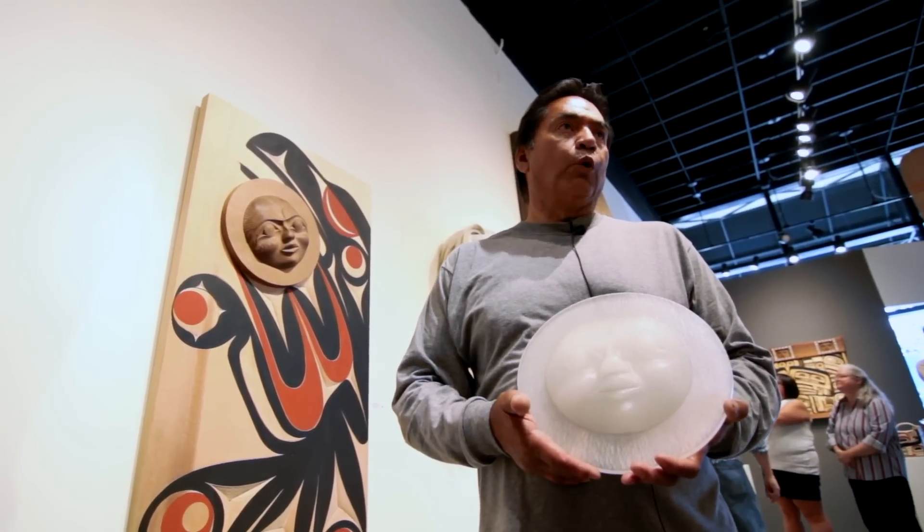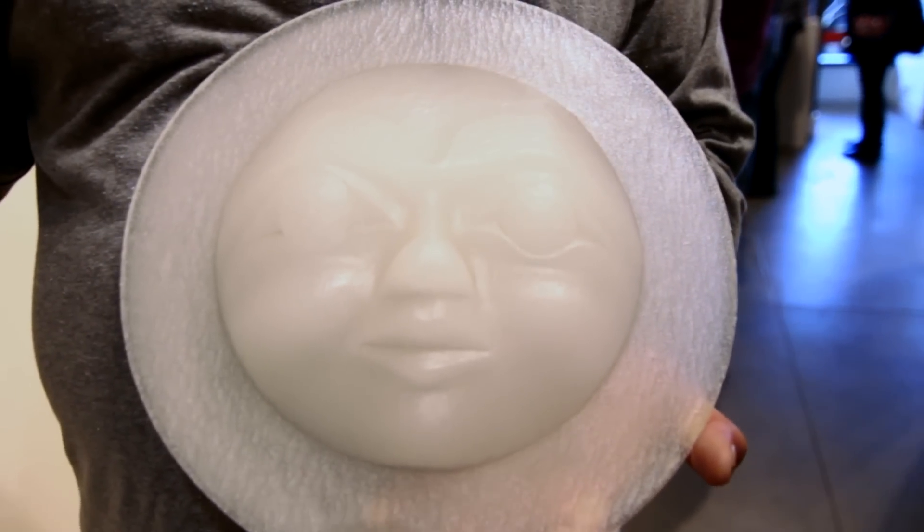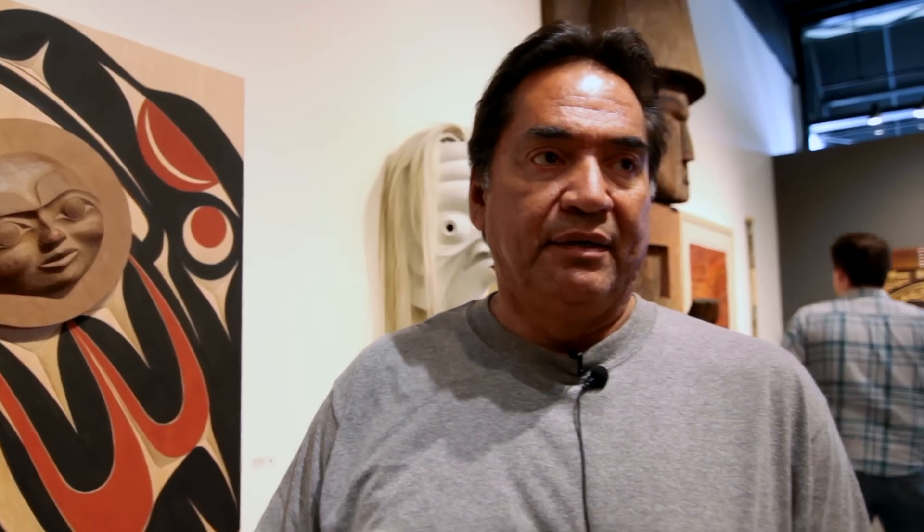You're going to make this mold. First, I took a month to carve that mask, just taking my time to get it just right. There can be no undercuts on this type of casting. So then I pull the wooden mask out of the mold and the mold has to release — if it doesn't release, then it's no good.